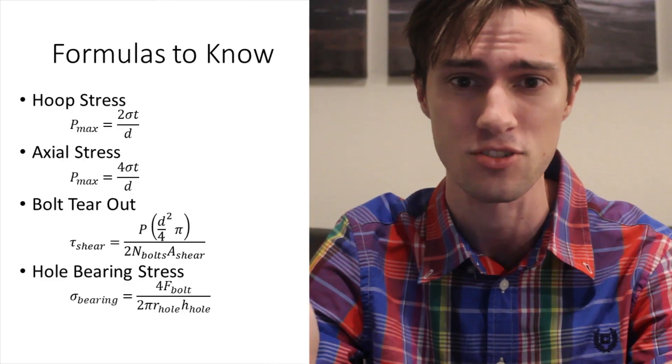In this day and age of computers, everyone is tempted to run off and ask a CAD program to do finite element analysis and solve for the structural properties of the case, but we really don't need to do this. It's super simple just to do a hand calculation. In fact, in industry, most aerospace companies won't even trust the output of a computer unless you can do a hand calc and get a close to similar result — it's too easy for the computer to follow the garbage-in, garbage-out principle. So we'll ground our analysis with hand calculations.